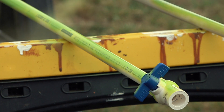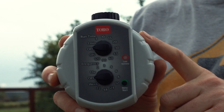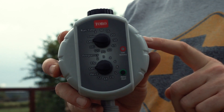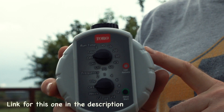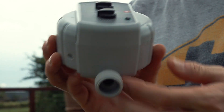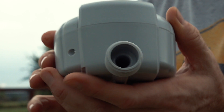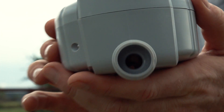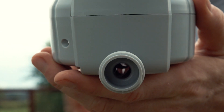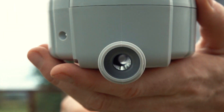While the paint dries, I want to install this automatic water timer, which is specifically designed for low-pressure applications. When you buy one, you really have to read the description — if it doesn't specifically say it's for low pressure, it probably isn't and will not work on gravity-fed systems. This one has a ball valve instead of a magnetic solenoid, so when I turn it to the on position it really opens the channel for water flow.